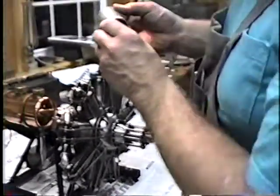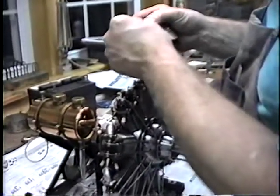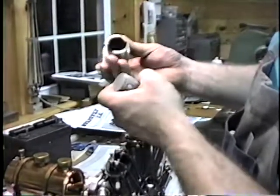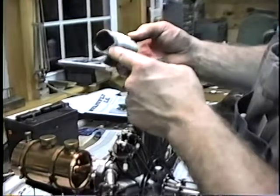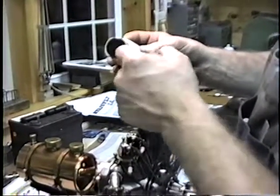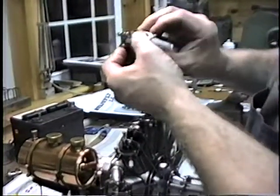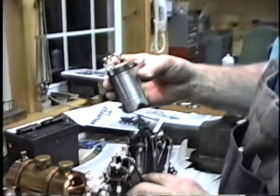I had a little accident when I first started it — I didn't have enough piston-to-wall clearance, and I had a seizure take place, and that's where this piston got damaged. But it gives you an idea of what the inside of the engine looks like and how big the pistons are. Each cylinder is made out of aluminum, turned from bar stock. The cast iron sleeve was turned from a piece of cast iron bar stock, turned to a very thin dimension and pressed in with a small shoulder. The cylinder head is held on with the four bolts you see right here.